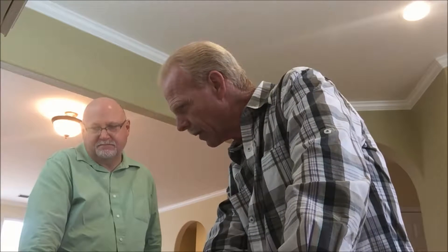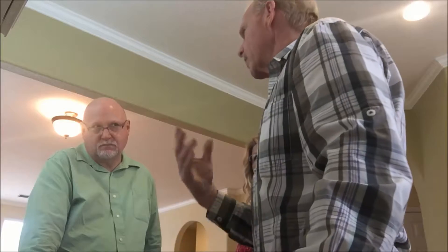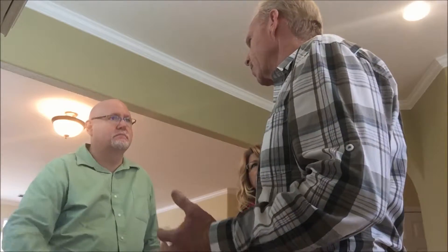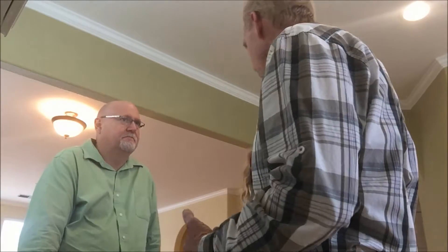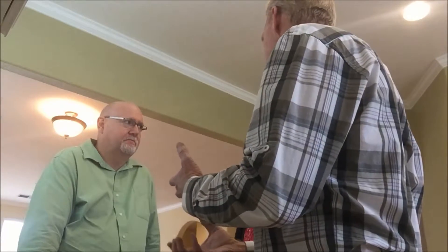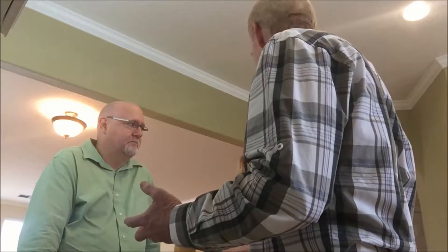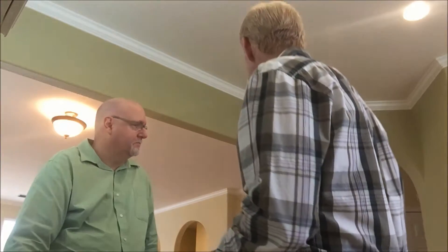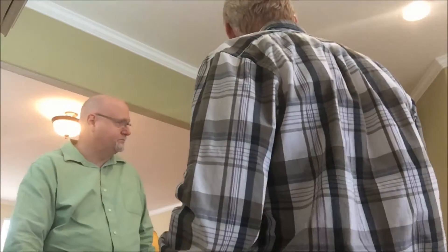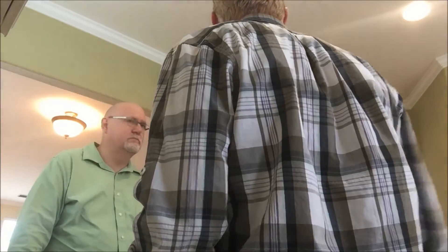The cover plate missing in the attic is an electrical issue. The doorbell button also needs to be properly replaced — it won't ding or dong until then. Other than that, all outlets in the house are properly grounded. Three-way light switching was done properly, nothing wired backwards. You may notice some outlets are installed upside-down — the top half of those runs off the switch when you walk into the bedroom. The first bathroom has a three-toggle setup; the first toggle doesn't seem to do anything.